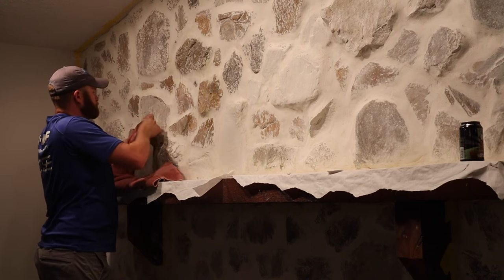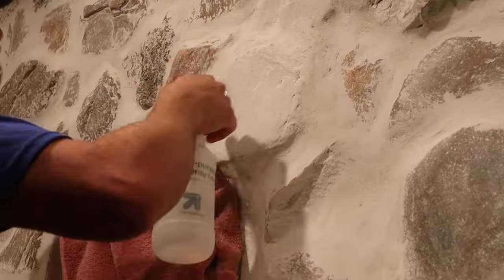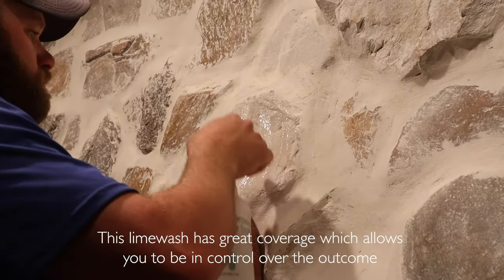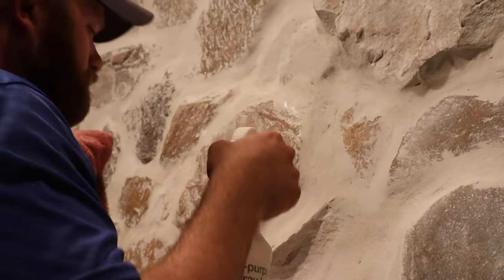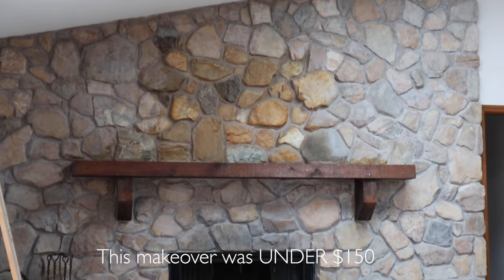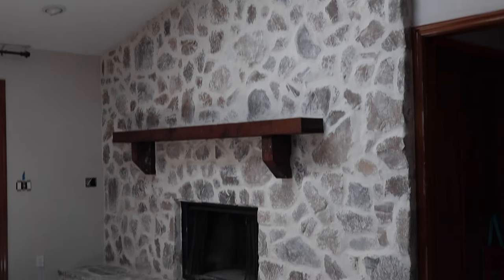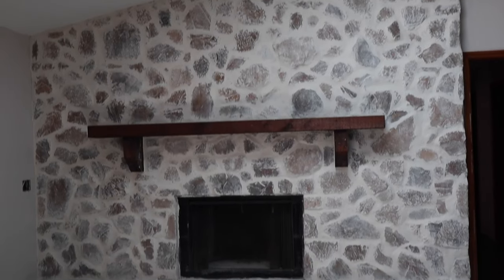Here's a view of Matthew and what he has to say. In the center of the frame you can see a stone with full coverage lime wash on it — if you like that effect you can leave it. If not, hit it with the trigger bottle, some water, and a rag to get the finish you want. You don't even have to seal it, so at that point you're done. Looking back at the fireplace before — I didn't love it — and taking under $150 I was able to transform it completely into this, with just mortar and simple tools you probably already have lying around.